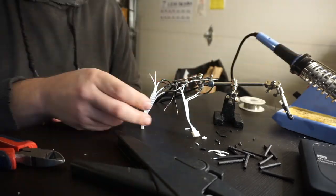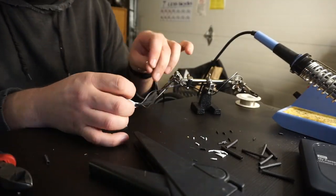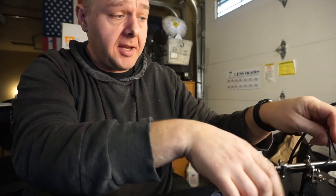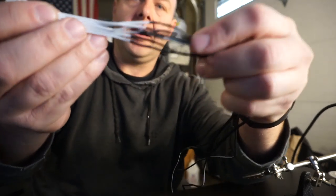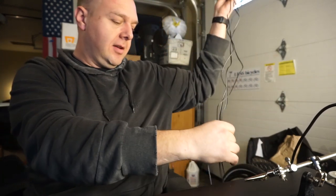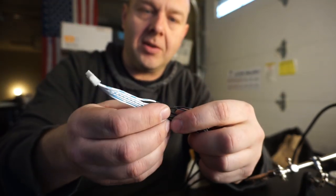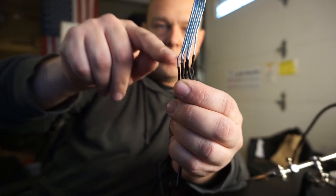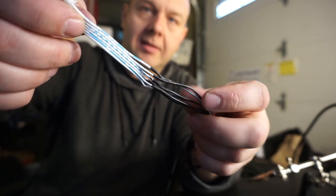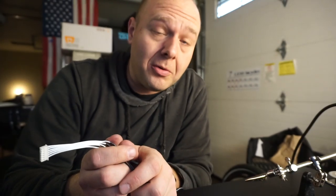I'm not going to lie, this is a lot of work. I've got four of the six done. Some of you may notice that I cut the flat cable at an angle - what that does is it staggers all of the solder joints so they're not right next to each other. When you get a bunch of solder joints right next to each other, they tend to stack up and make a great big bundle. By staggering them just a little bit, it moves each solder joint down just a little. I think this is pretty good - I'm going to grab the voltmeter to double check and make sure these are all set the way they're supposed to be.